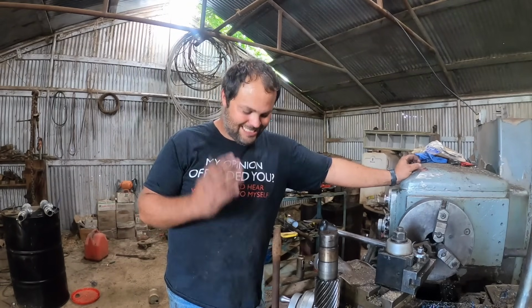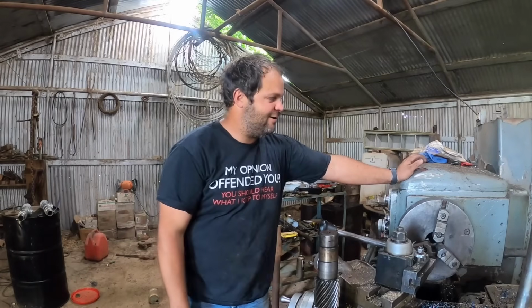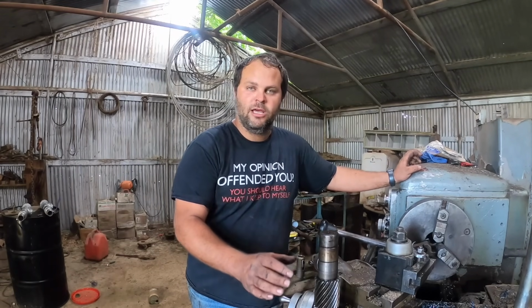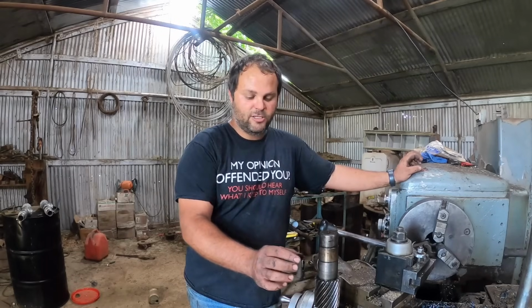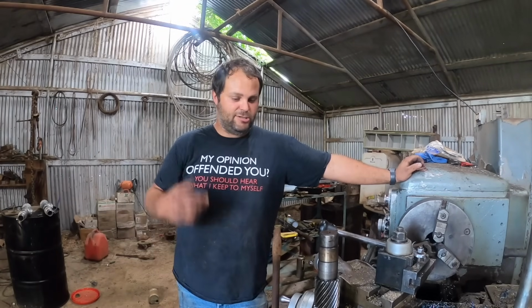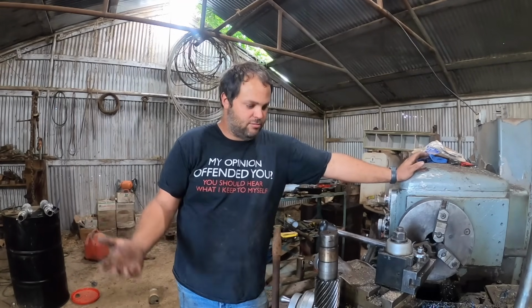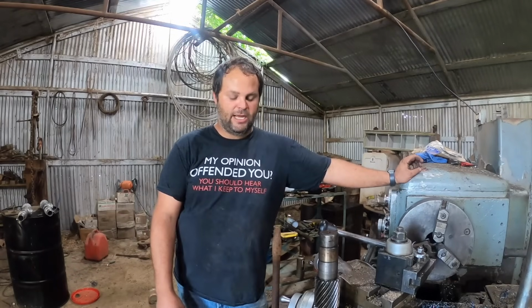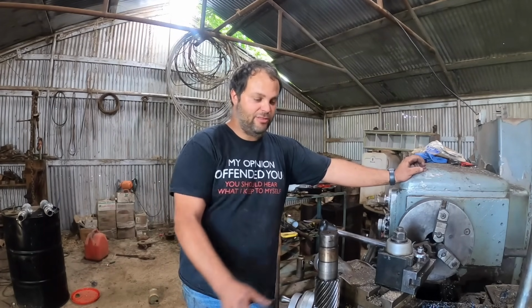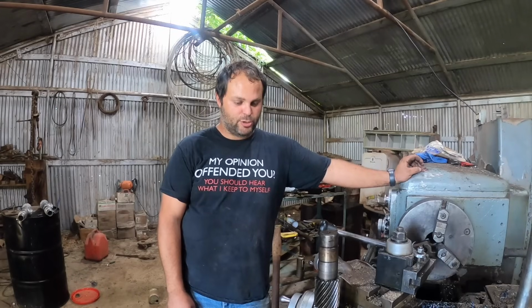However, I've got to make the point, because there's going to be a lot of people that know me personally that know who I'm talking about here. I'm not bad-mouthing him. There is certainly a possibility that these gears aren't original, and that whoever made these gears made them as a set, and they were a slightly different size. It's possible that the Idaho book didn't call out nominal numbers. It wasn't 1 7/8. It was just, you know, 1 inch, 0.87, what would that be? 70, say 80. 1 inch 880, you know, for the shaft. And whoever made these gears, or at some point in Idaho's, you know, when they built these, they made them a little bit different size. There's absolutely that possibility that what he made me is to spec, but I've got something oddball.